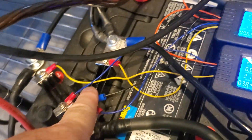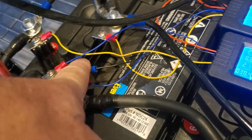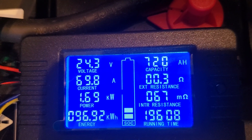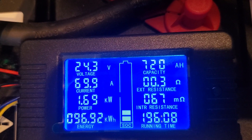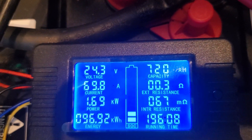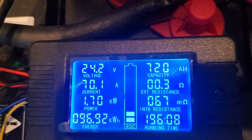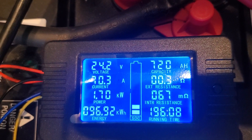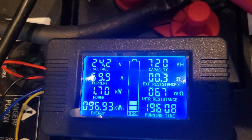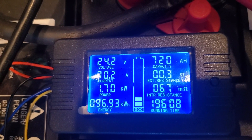Because this is an all-in-one with an inverter, I have it going straight over here to my other one that also goes to this inverter. The job of this shunt right here is to measure the draw on the batteries, and that's this top meter. Right now we're drawing 70 amps between everything hooked to that shunt, which is 1.7 kilowatts at 24 volts. And when we hit 23 volts, the cutoff will trigger.